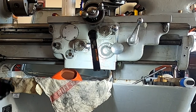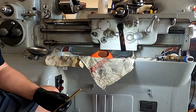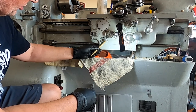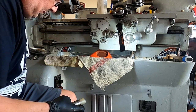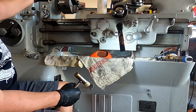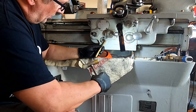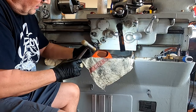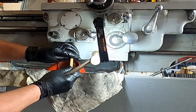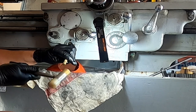The way I've always taken them out — and it's always worked well for me — is I'll take a brass punch, and what I'll do is round off the end so there's no sharp edges. I want it to be able to serve into here without doing any damage. It's kind of hard to do off-handed like this; I prefer to be up above this, but since we're doing a video here it's going to be kind of awkward. There she goes.